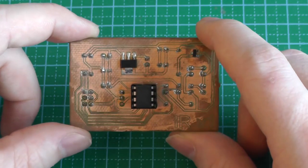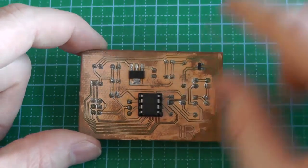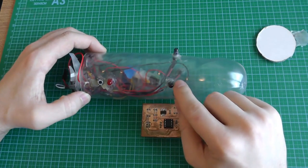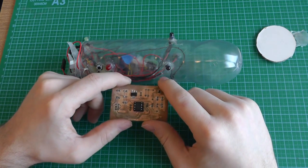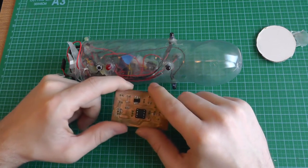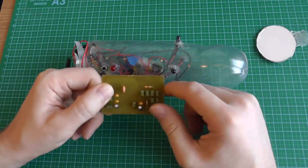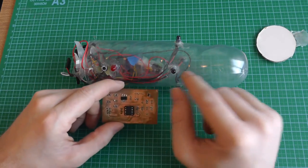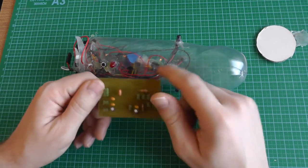I'll put the schematic online on the wiki, and not on the Git this time, but it's pretty simple. With that, you can already have a lot of fun, with a simple thing like infrared LEDs blinking. It's a good entry project if you've never programmed microcontrollers. Setting up the timer, probably looking at interrupts, putting the microcontroller to sleep so it doesn't draw a lot of energy, using a PMOS to drive high power LEDs, and using a voltage regulator to have constant current.